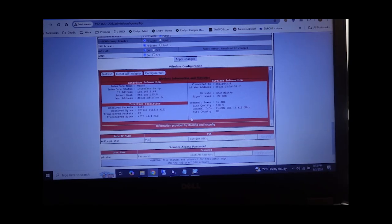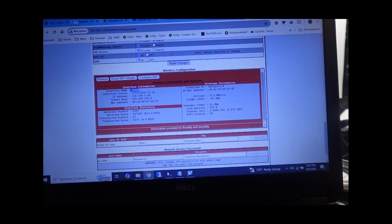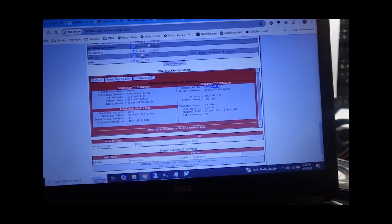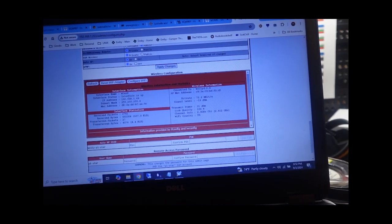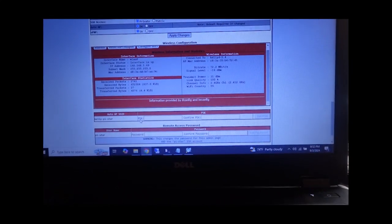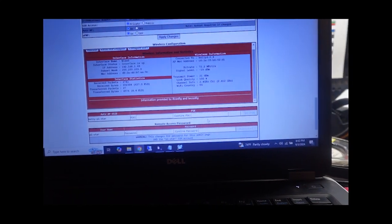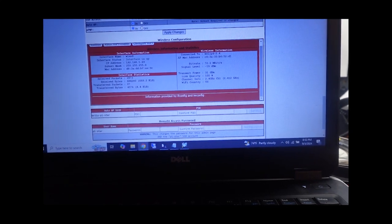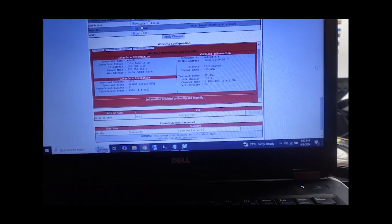The latter part of this is, of course, your Wi-Fi. Here's my WLAN. This is where I'm plugged up, hardwired. But then again, here's my SSID that I chose for my Wi-Fi. So I have two connections: a hard link, and a Wi-Fi. Then you come down here and you can change your auto SSID by putting your PSK password in. And the remote access, this is one you'll need to set your password. Please set your password on this for accessing Pi-Star.